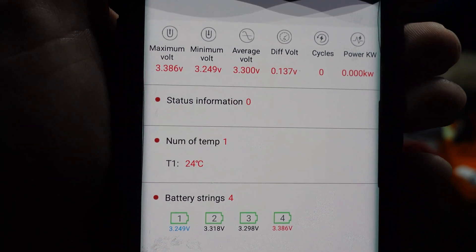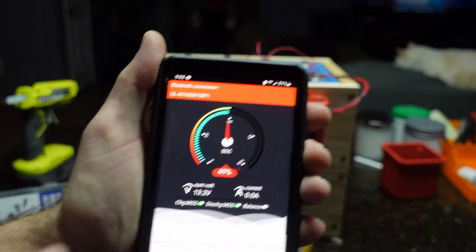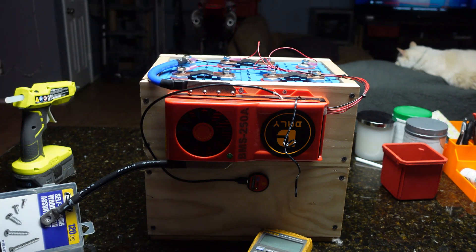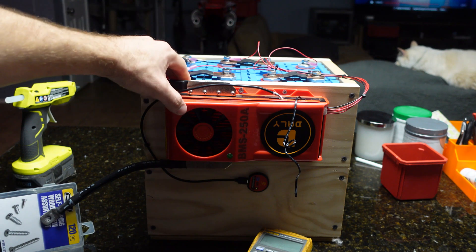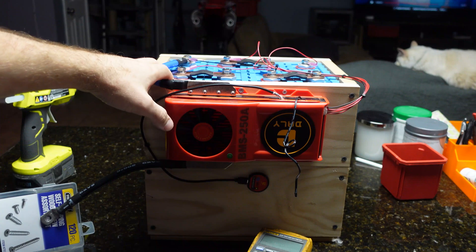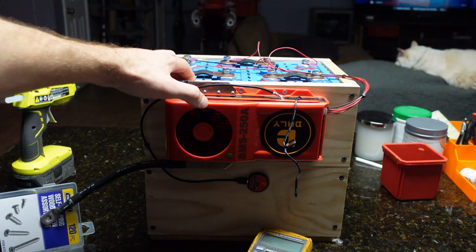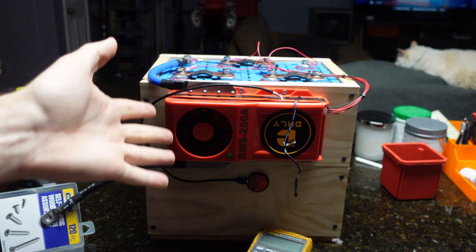Once I get the battery fully balanced, we're going to fully charge it, reset the state of charge, put the Anderson cable on, and put this thing into service. I think I'm going to use this as a portable power bank, but for now we'll probably put it in with the other stuff and add another 2,000 watt hours of capacity — so that's pretty good. In the next video we're going to do a bunch of testing and see how close we get to the rated capacity, because like I said, these are Chinese used cells from AliExpress and they're about $430. We're going to see if I got ripped off or if these are actually worth buying. Thanks for watching — leave any questions in the comments.